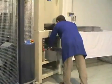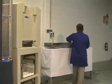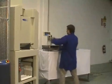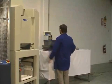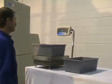When the bin is in the correct place under the crusher there is a switch which allows the machine to start up. If the bin isn't in the right place the crusher won't start. If the bin moves during the operation it won't start.